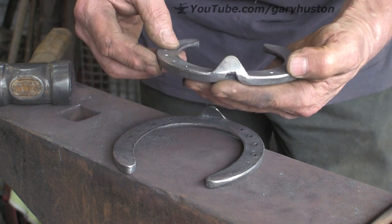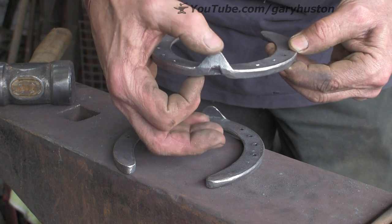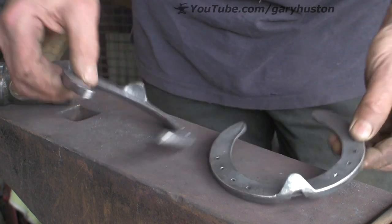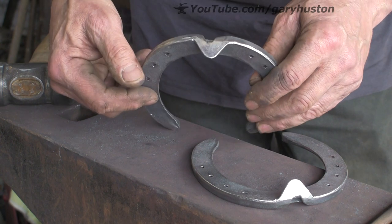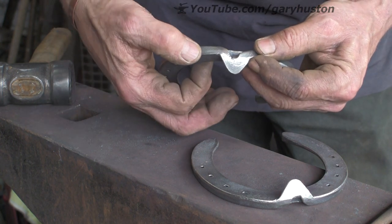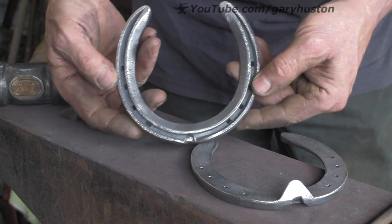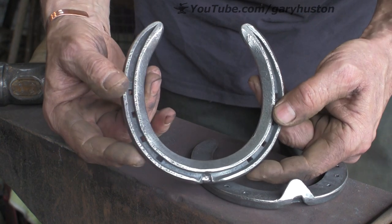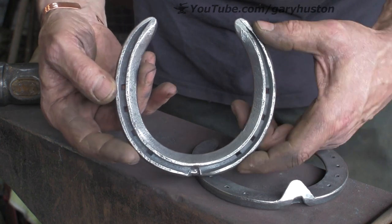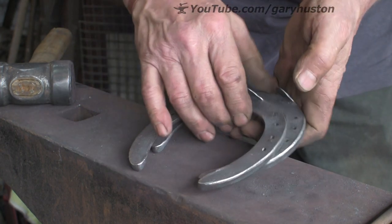Now your clips should be about the width of the material for the height, and the base of the clip — that width should also be about the width of the material. So you've got plenty of meat, a good size. There you go — nothing fancy, back to basics. Thanks for watching and we'll catch you on the next one.